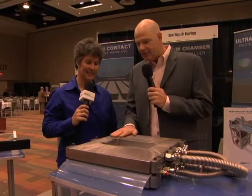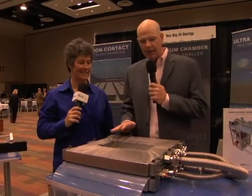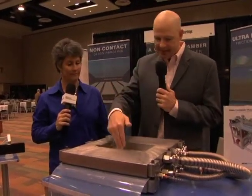Now we're at the other part of your booth — what is this one all about? This is the pass-through vacuum chamber stage. It was actually sponsored by a FlexTech Tech Council research project, and it's been successful. We were able to achieve 10 to the minus 6 Torr in the process chamber. The film goes from atmosphere to 10 to the minus 6 vacuum and back to atmosphere in less than half a meter, which is really quite a trick.